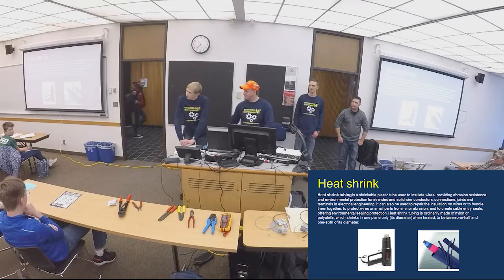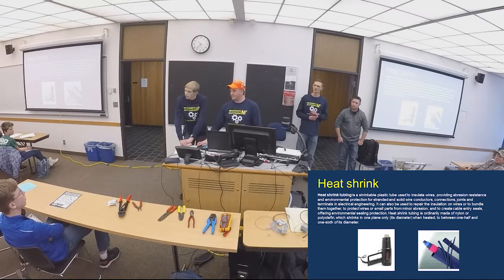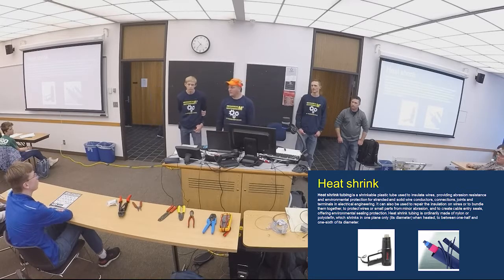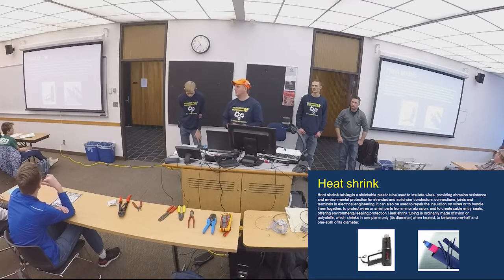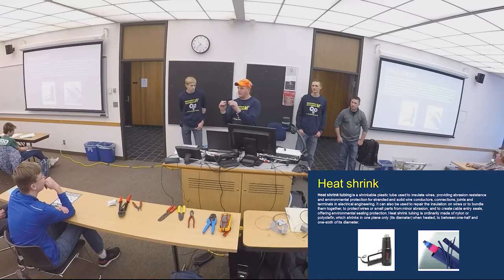Solder wick or a solder sucker? That's more like bigger investments. I've used both, and the wicking is great for PC boards. Usually, if you're trying to do it off of a wire, you use the sucker to suck the solder as you're melting it off. Sometimes it's hard. You can wrap it on there and kind of heat it up. That's a little trickier. If you've got little clips and a holder, it's easier to do it that way too.